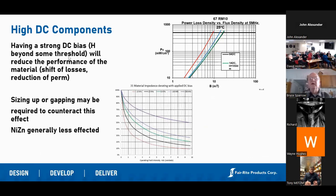Same thing with high DC components — when I talk about high DC components, I'm talking about DC bias. A typical application you might see in ham radio is a MOSFET amplifier with a bead off one of the MOSFET legs — that bead is there to absorb the switching EMI that MOSFET is generating. Well, it works well until you get a high DC bias, talking about many amps, and then ferrite will have to be derated. It basically swamps out that ferrite material and really drops both the permeability and the impedance it's generating. Nothing you can really do about it, but it has to be derated and typically more ferrite needs to be added. In today's generation of MOSFET amplifiers you'll typically see beads on those legs, and that circuit designer had to take those high DC components into consideration.